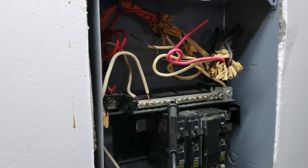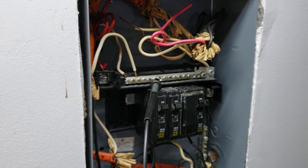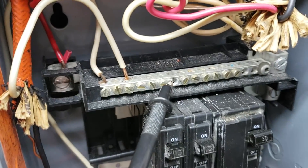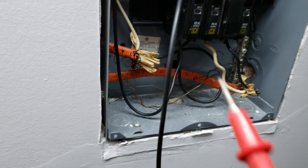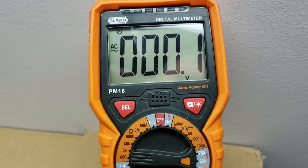We've got this unit apart. This is live right now - this was the previous owner of this house, this was here when I got it, so this is not my work. What a disaster this is, but we can test with the meter and see whether we've got any power. We've got two bus bars. I've got one probe on the neutral, and on one bus I'm reading 118 volts. The other bus is over here and I've got zero.